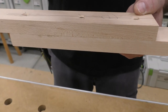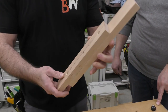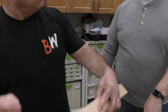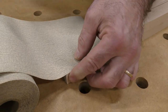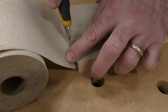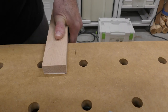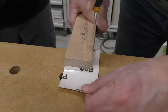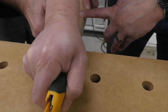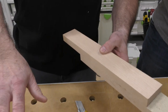This fixture is going to work with the miter saw hold-down and give you repeatability. You can bump it in, and also prep it for longer or shorter pieces. I'm going to be proactive and do two at the same time. I'm taking some sandpaper — this gives it extra holding power. I'll trim it across like this, bring it around, and trim it. Don't throw the leftover piece away — we'll use it on the other side. Feel that? It's pretty rough. You can't have enough sticky-back sandpaper.